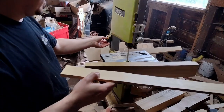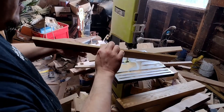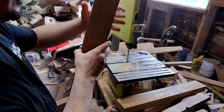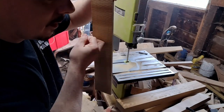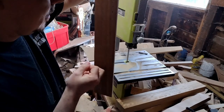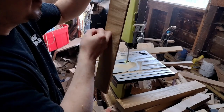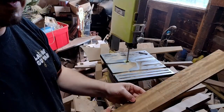That minimum thickness is going to be the maximum thickness on the board when it's done. Let's do the tap tone — dull. I might as well be knocking on a piece of pine. Weirdly though it's got 1200 on the Janka hardness scale, so it should be okay considering the use. I've never really seen anybody use it so I'd like to prove as much as possible why people don't use it.